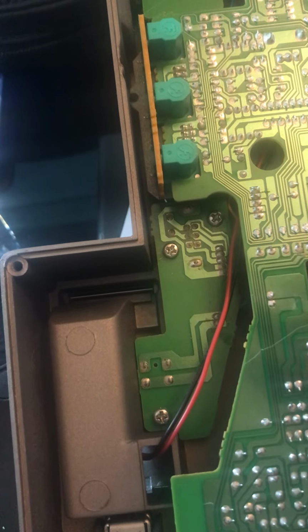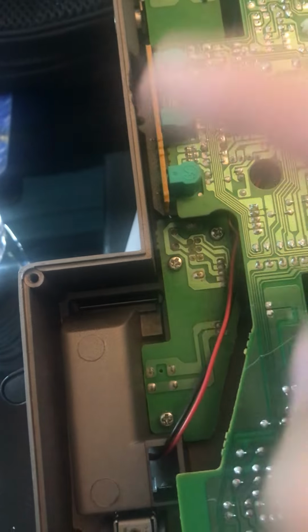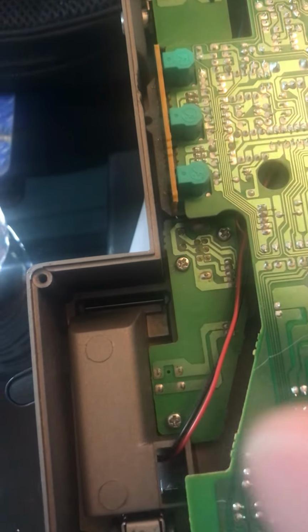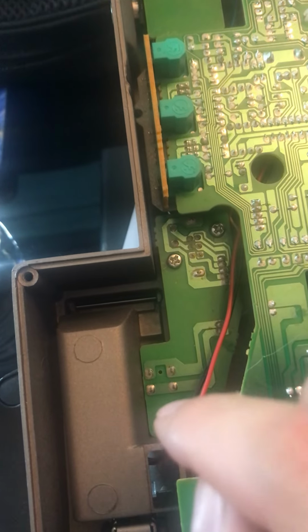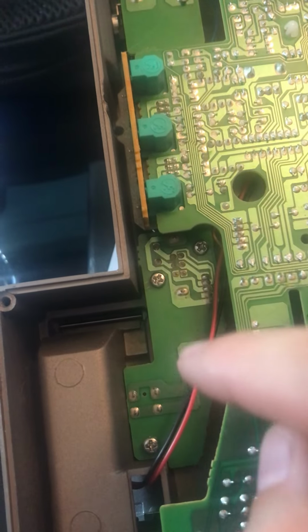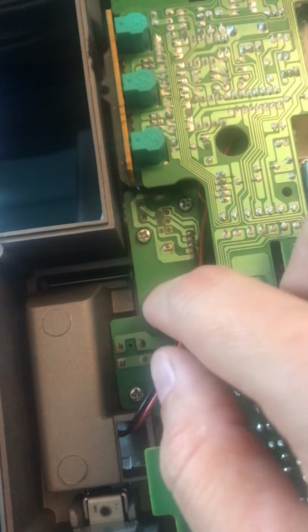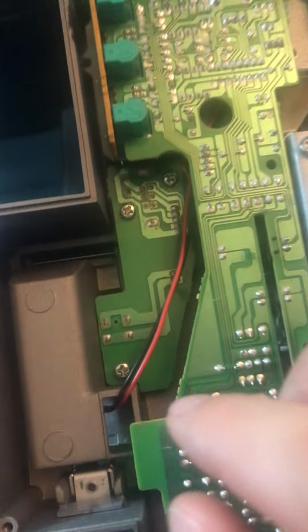Bad idea. It's just like a car tire. If you go to change a car tire, you're going to tighten the nuts, but you're going to have all the nuts on there before you do your final tightening. So it's not like you're going to really torque one nut down and then go to the others. Basically, you're going to finger tighten things, then you're going to go through and actually tighten. So when you do that, make sure that you do the same thing in the circuit board world that you do in the mechanical world.